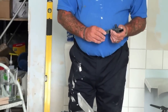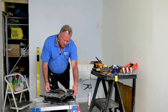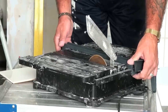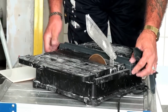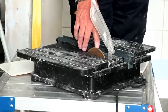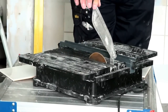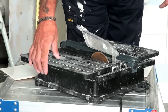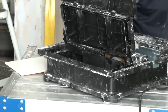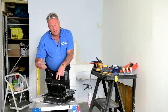We're plugged in and ready to go. This particular cutter and cutters like it have all got similar features. They come with a moveable guide on one side so you can move it backwards and forwards to suit the size of cut you'd like to make, and they simply clamp up against the side of the machine. The blade itself is in the machine or comes separately with easy instructions on how to fit it, and of course the blade has a guard. These are water cooled machines, so water splashes on the tile as you cut it — stops it burning, stops it smoking.